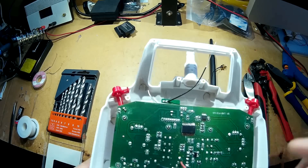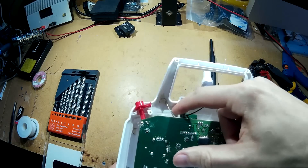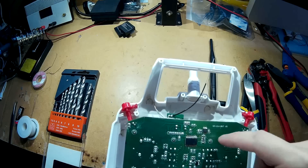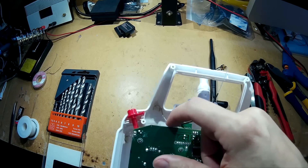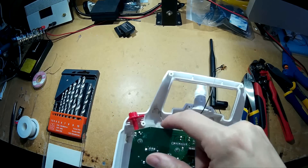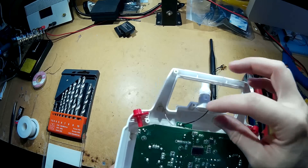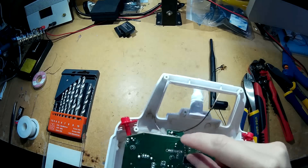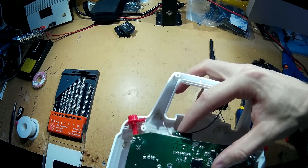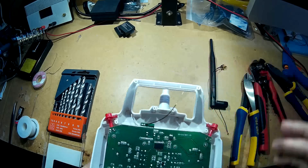Hopefully you can see that. Here is the antenna — this black piece here. This piece here is part of the antenna as well; that's the ground plane, and that's why this transmitter has got quite a bit of distance, just because of that little bit of added wire there. So don't touch this piece here, there's no need to touch that. The actual antenna is on the top here, and it's just a matter of unsoldering this first. You've got the antenna point there, which is the center core, and then you've got the ground soldered on here, which is the shield — the outer core of the wire.